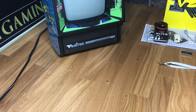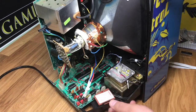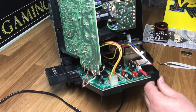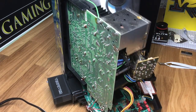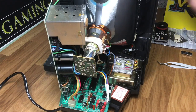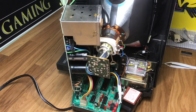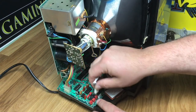Now let's go ahead and turn the Vectrex around. The cover is already off on this one. The manual shows you what screws to take out — there's a couple here, a couple up here. It's very simple and straightforward. Once you get the top off, you're going to look for the audio chip. Now the XYZ cable — sometimes I'll unhook that right here to simplify things and get it out of my way.